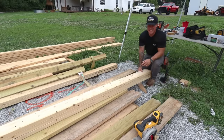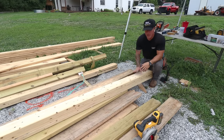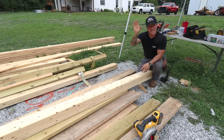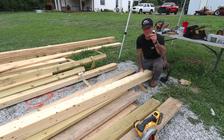So you remember we raised the six by six post with a 4x4 and the tractor as a boom extension. So because we did the shed roofs on there now, we're not gonna be able to have enough reach to go over the shed roofs. So I'm gonna try and go up to the center, raise these last 20 foot beams the same way, but to get a little bit of extra length, I'm gonna use 3 2x6s. These are 16 feet long, so we're gonna screw all these together and make a longer tractor beam, and hopefully this will work and help us raise these into position.